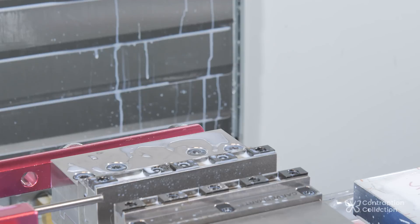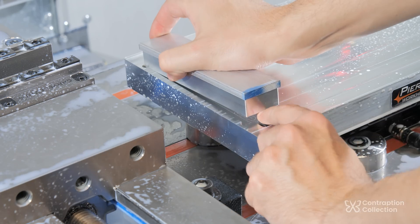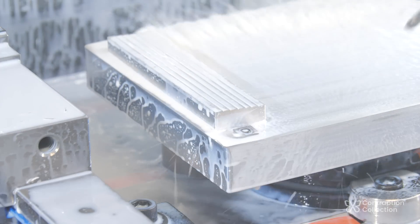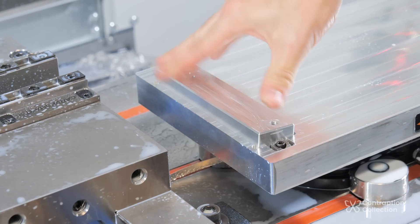Machinewise gave me a good method for how to do it. First, I make the top of the block that will end up angled. I have to make a step to support the new hollowed section on the back of the blades — I cut a path where it needs to be lower to keep the top mostly flat. The outside of the block needs to be a tight dimension. Next, I cut a pocket in the pallet the same size. Now I can use a couple pit bull clamps to hold the block upside down — it's a very tight fit. This lets us get rid of the extra material, then I can cut the 5-degree angle I need using a ball end mill. I can flip it over again, and now that first side is at an angle, which is what we want.